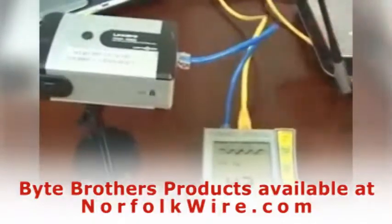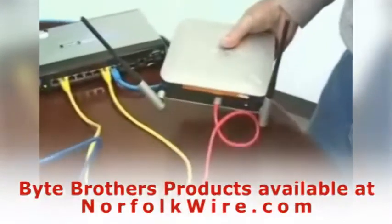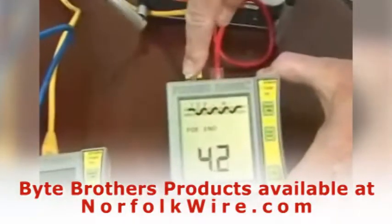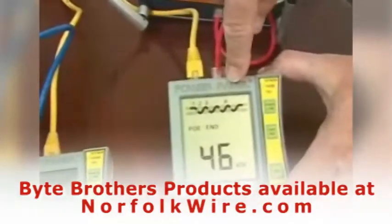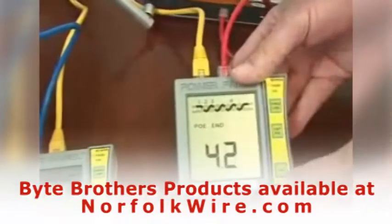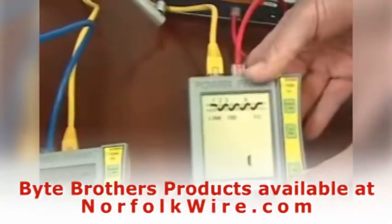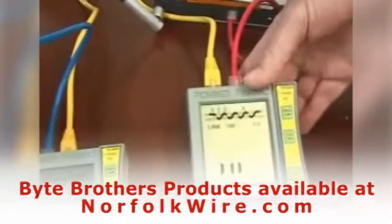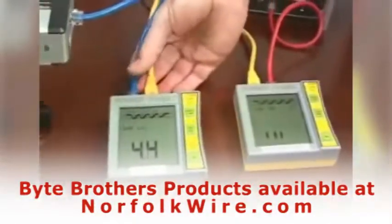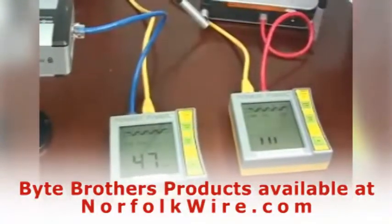Moving over to our access point — likewise, no separate AC voltage, powered by power over ethernet. The PoE screen shows 46 to 47 volts on pairs 1, 2, 3, and 6, drawing 4.1 watts. The network screen sees the same switch, also on 1, 2, 3, and 6. If PoE power were being injected mid-span on a rack, that would show up on pairs 4, 5, 7, and 8, and mid-span power would be indicated.